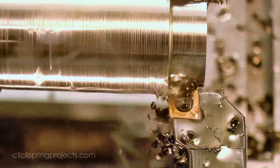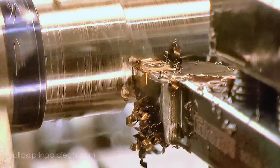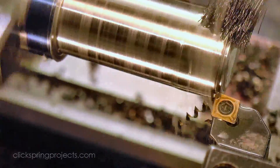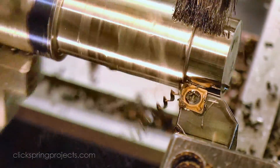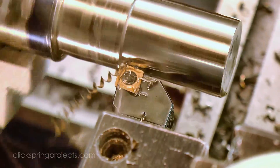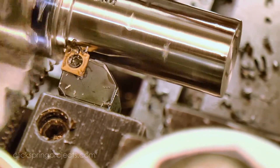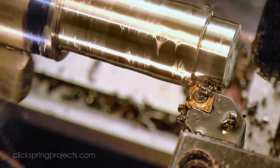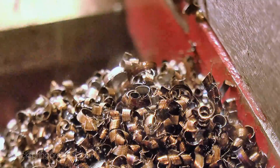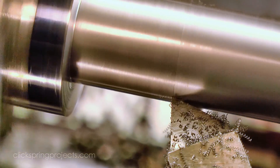One of the things I've noticed about these inserts is that they seem to work a lot better if they're loaded up with a decent depth of cut. For this pass I've set it to 1.2mm, so that's 2.4mm off the diameter in total, which is quite a decent cut for this little lathe. Interestingly, backing off the cut depth just a small amount to 1mm, whilst maintaining the same speed and feed rate, reverts the chip back to a continuous form — although the chip breaker does force it into a tight helix, which still makes it a lot more manageable than with no chip breaker at all. But if I increase the cut depth back to 1.2mm, the insert goes back to splitting out nice small chips again. I still prefer high speed steel for the finishing cuts, but the inserts definitely make the rough stock removal with tool steel a much more pleasant experience.